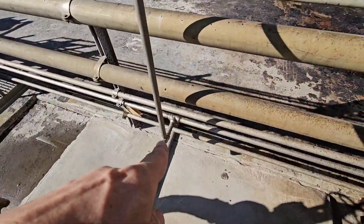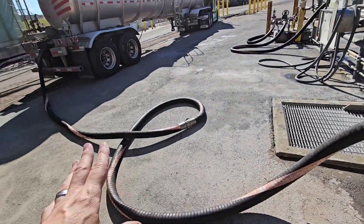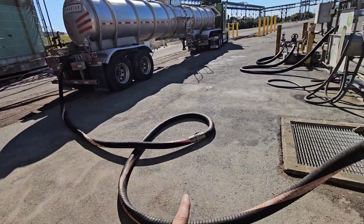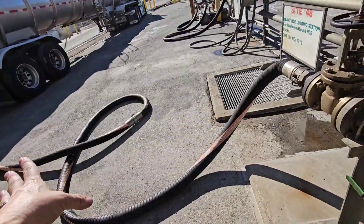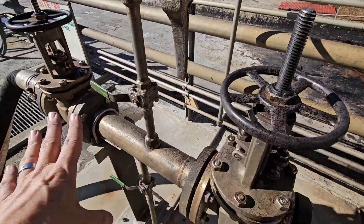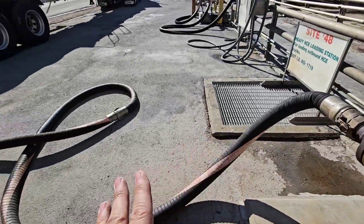Then you cut your air off and open this valve, which is a bleed-off — it bleeds all your pressure out and releases the pressure that's in your hose. With all your valves closed, you close that external valve. With this bleed valve open, all your air pressure comes back out because nothing can go anywhere except through this line right here. That's how you clear a line.